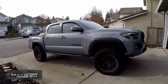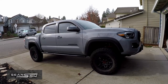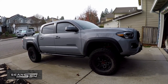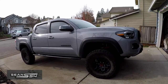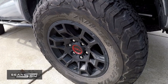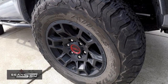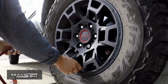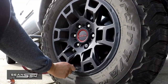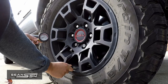What's up guys, I'm Sean. When I take my Tacoma off-roading, airing down the tires for the trails and then airing them back up for the drive home is very time consuming and tedious. On my Tacoma I run 33s, 285/70/17, and usually when I go off-roading I drop it about 10 PSI. Dropping it 10 PSI takes about two minutes per tire, and it's very tedious on my fingers while I'm squatting or bending over.